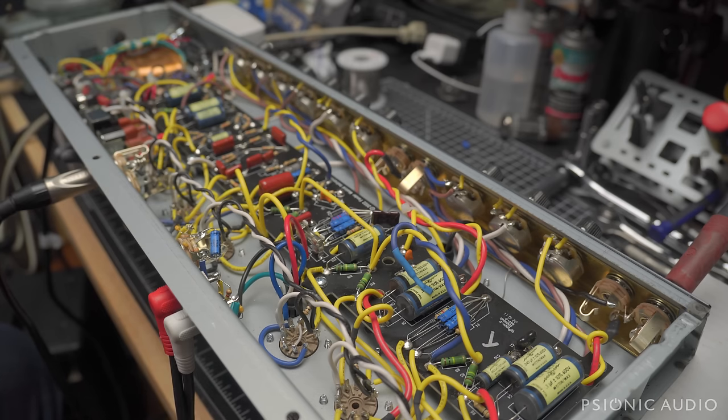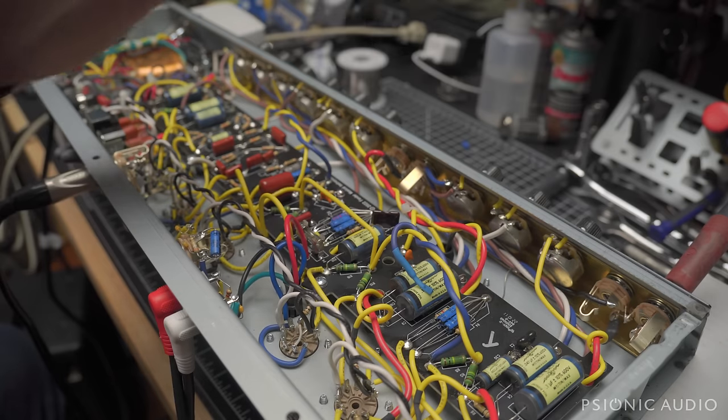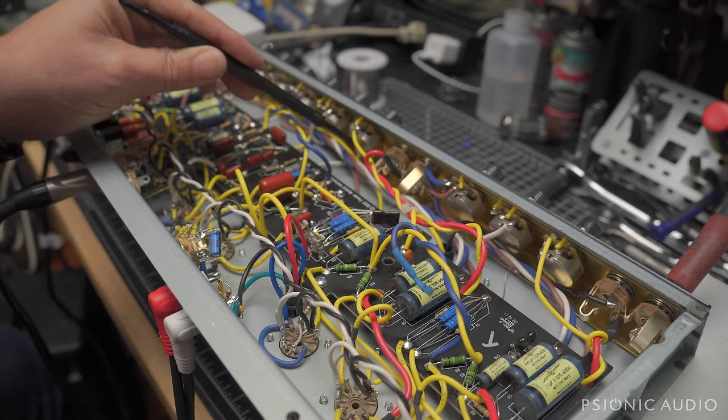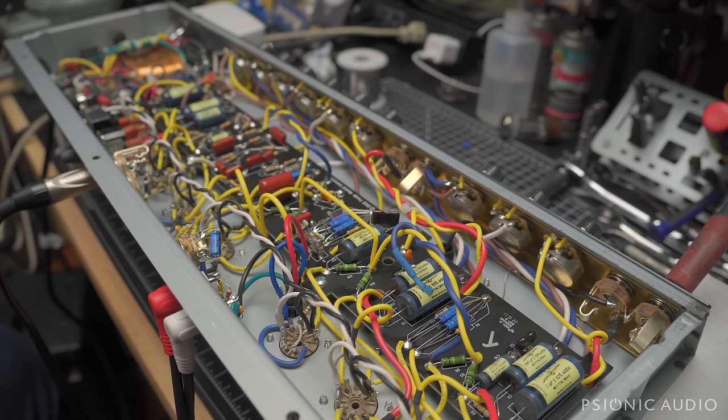Before making any changes to the board, I went through and tightened all the nuts on all the jacks and pots, because that is how grounds are made in this amp. Every single nut was loose — if not fully loose, just beyond finger tight — and that's not good enough when you are relying on jacks to make grounds for all the filter caps. Volume pots have grounds made to the chassis through the nut being tight. That noisy volume pot from before — tightening everything fixed it. Output jacks, footswitch jacks, reverb jacks, input jacks, bias pot, all pots, all transformers, and the AC safety ground wire are all now tight.